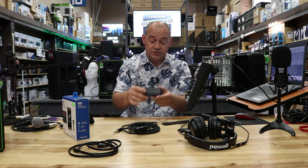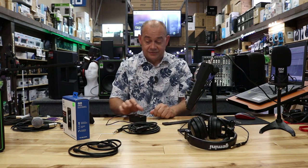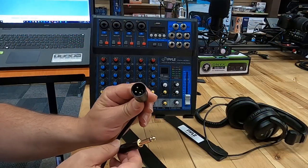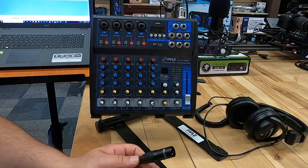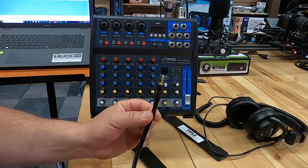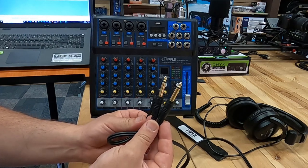These devices operate on batteries — in this case a nine volt. If you're going to do this, start with a fresh nine volt. We've got our audio interface, the TC Helicon GoVocal. We're going to need a proper cable: the first one is a male XLR three-pin to a quarter inch unbalanced. The other cable we need is a stereo 3.5mm adapter — the same one you'd use for the iRig — going out to two unbalanced quarter inch connectors.